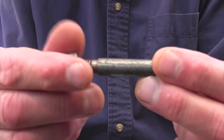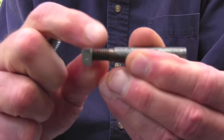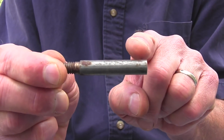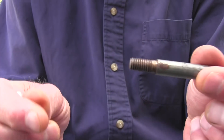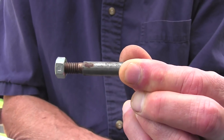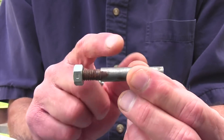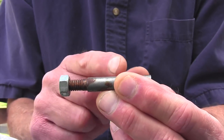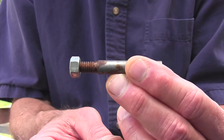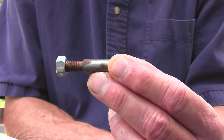Let's start with shear bolts and the different kinds. This shear bolt from my post hole digger is a special bolt with a tapered shaft — it's bigger at one end. It goes in and a nut goes on; it's specially made and I've got to buy it from the manufacturer. I could just use a regular bolt, but this one is hardened in specific areas, designed to break at the right moment. Post hole augers are under tremendous pressure, so I invest in the proper special shear bolt.